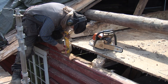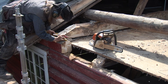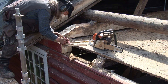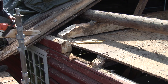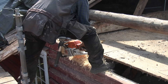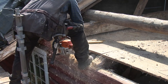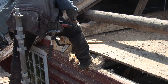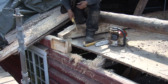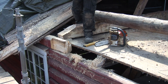Really, the rot doesn't continue as long as it has structural integrity enough to hold up the roof above it. Rot doesn't continue if it doesn't have any water. So now I'm going to put together, like I did in the first two films, two pieces of timber with this kind of union — it's a kind of joint. If any of you know the names of these in English, that would be very helpful — if you could tell me what these parts are called in the comments. I'm not even sure I know what they're called in Norwegian actually.